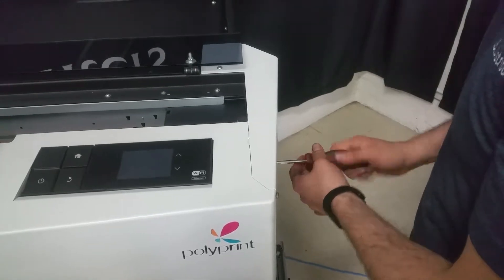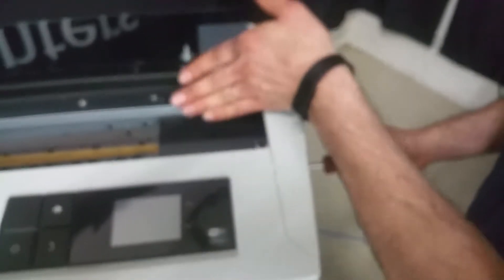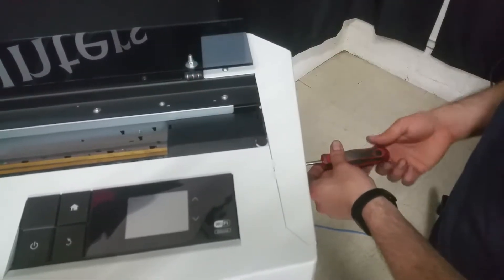I have to do this one more time. Turn it clockwise until the printhead pops up, then move it counterclockwise again until it drops down — and you can see the printhead drop.